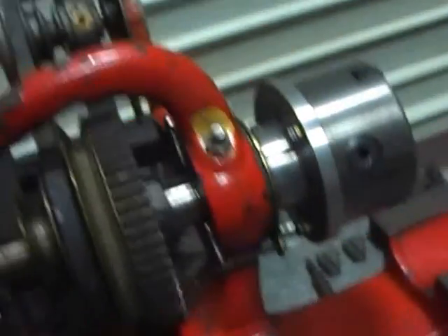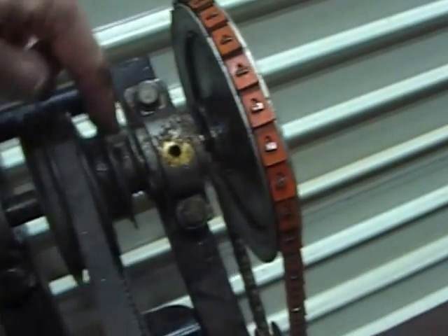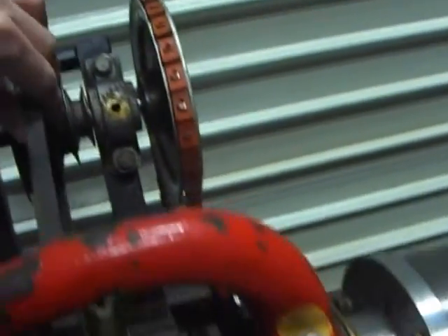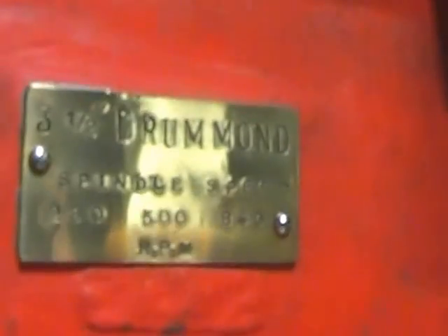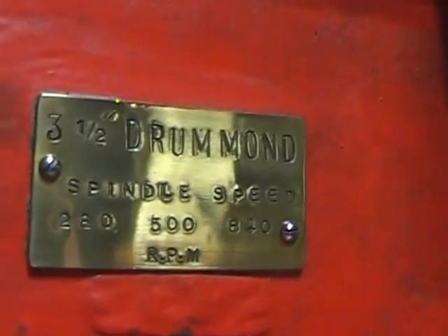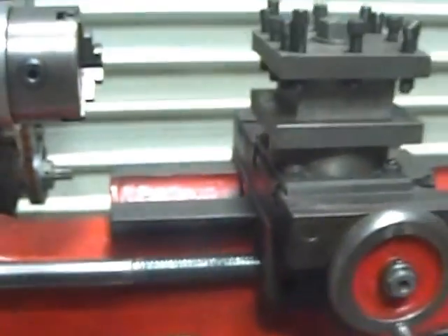So you've only really got three speeds. You can just about get the fourth by tweaking things over using a smaller diameter, but the three is quite good, actually. There's a lovely brass plaque here and it's got the speeds on - if my camera will hopefully pick that up - which is 280, 500 and 840 rpm. Not checked, but I'm sure they're reasonably near.